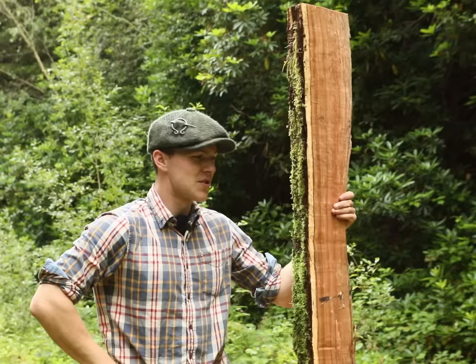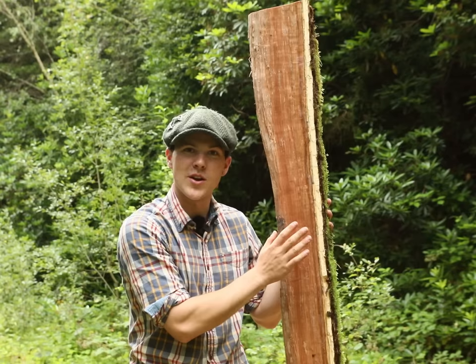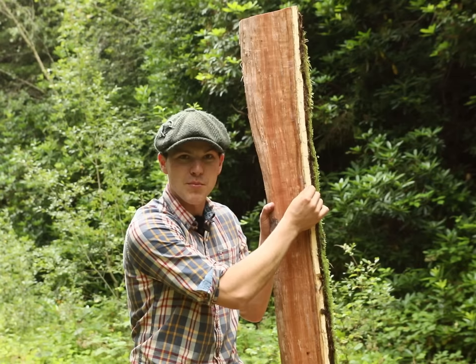So after a hard day's work, this here is probably the best fruit of our labour. You can see it's fairly square as it is, about 80 inches in length, very tight grain. We won't need a whole lot of work with planes to get this looking like a modern square plank, even though that's not exactly the end goal — we are trying to make it look like it was done entirely with hand tools. You can see this portion of the wood is sapwood, which is useless. You want the hard heartwood, which is this darker wood here.